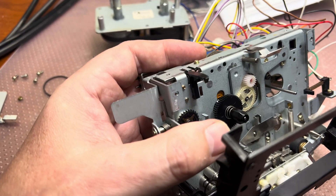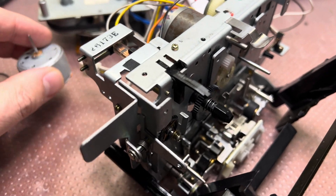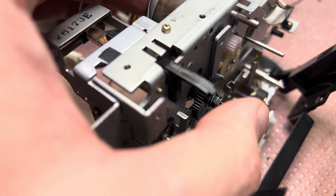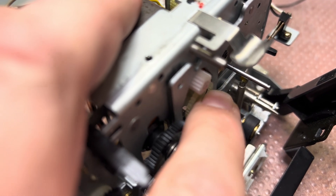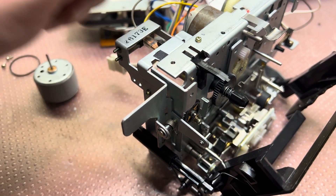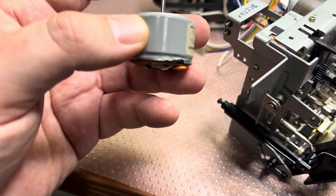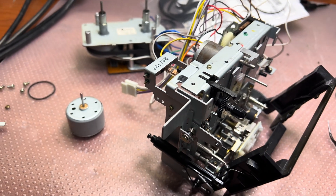I'm trying to restore a BX 300 and I just installed the new motors I received. The shaft is a little bit shorter - about a couple millimeters shorter - and I can already see that if I install everything properly the white gear will go behind, so it will be slipping. The only chance I have is to replace the shell with a good magnet and use this rotor with a longer shaft, combining one motor to see if it will work.